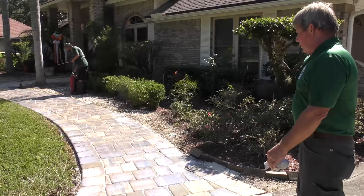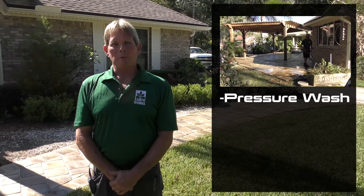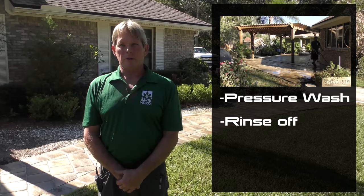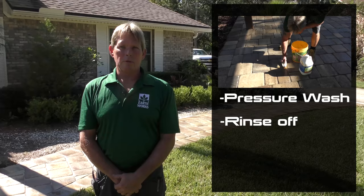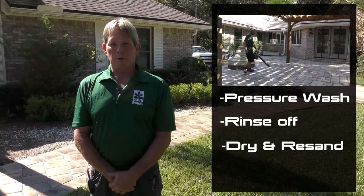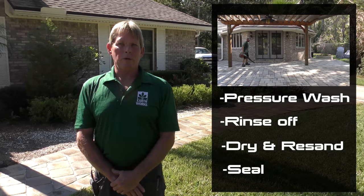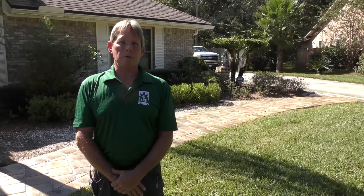Remember not to step on your wet pavers because you might have dirt, a rock, leaves, or whatever on the soles of your shoes or boots and it will transfer to the pavers — and if it stays there, it's there. We pressure washed everything, then came back and rinsed it off so it was all nice and clean. Go over it a couple of times to make sure there's no residue left on the tops of the pavers. Then make sure everything's nice and dry. If it calls for re-sanding, go ahead and do that.